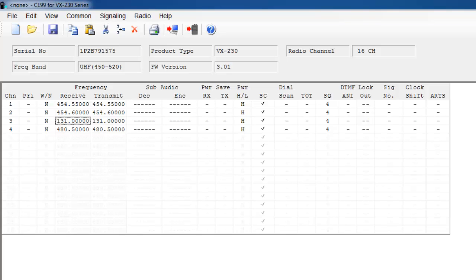I'm going to change channel 3 to 451.7 receive and 451.8 transmit and hit enter. In most radios, each channel is programmed to two sets of information: you have your frequency and then you also have your privacy code. Almost every radio manufacturer will have a different name for a privacy code — you'll see PL tone, CTCSS, DCS, sub audio, tones, code, CSQ. They all pretty much mean the same thing. It's just an extra layer of security on your frequency so you're not hearing everybody on that frequency.